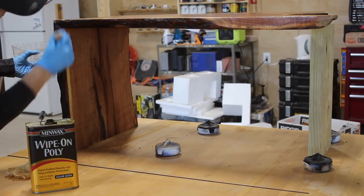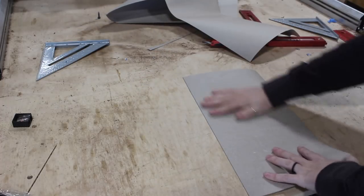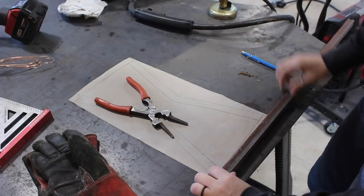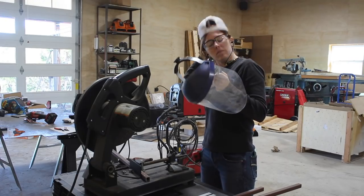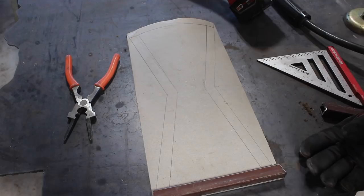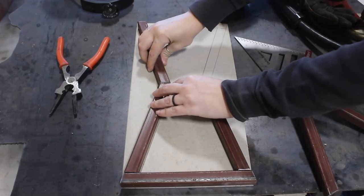While the finish set up I started working on the other leg for the table. Originally I was going to go with a wooden mesquite trapezoid - a trapezoid is kind of the go-to leg for this style of table. But I decided to go with a bowtie-shaped leg instead, just the outline of one. Since my milled mesquite won't be dry for another year, I made this leg from some three-quarter inch square tubing. I started by drawing the leg to its exact size on construction paper, then placed the tubing on the drawing and used a square to mark off where it needed to be cut and at what angle.